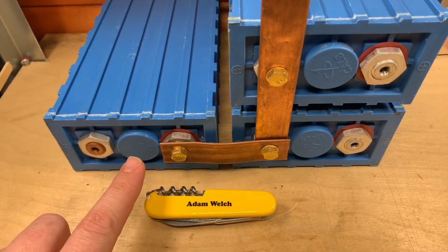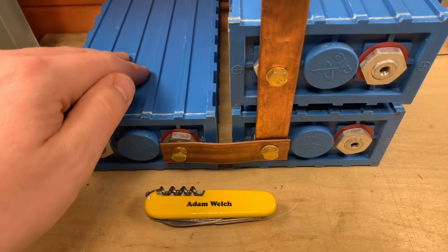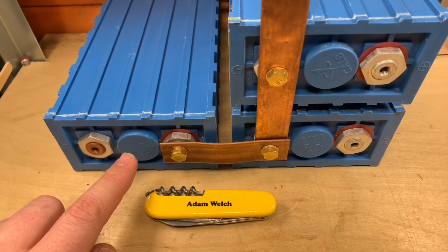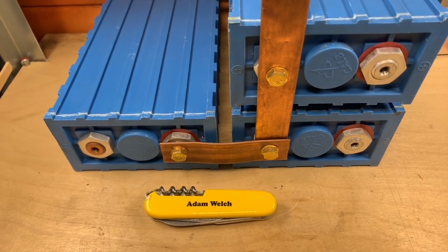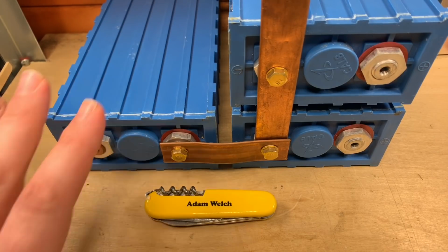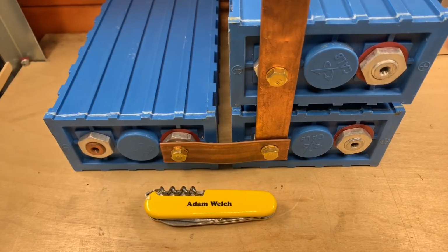Now, they all have a pressure valve on top of each cell, but it has been known, and it's quite frequent, that the cells actually expand before the pressure releases in those pressure release valves. And if they expand, well, the capacity sadly goes down. So generally people put them right next to each other with no gaps and actually compress them together. So that's the plan for today.